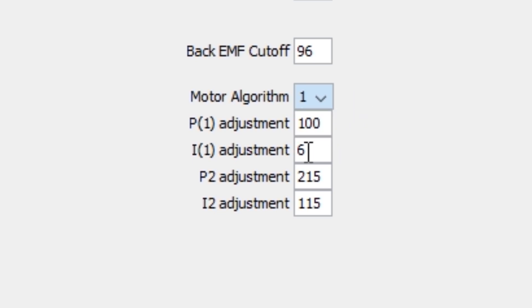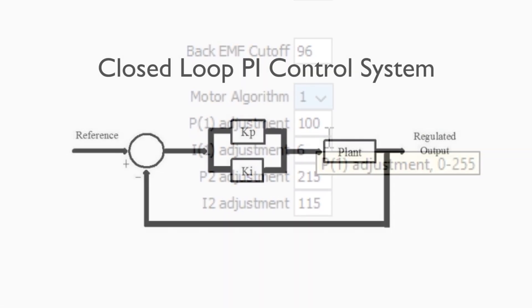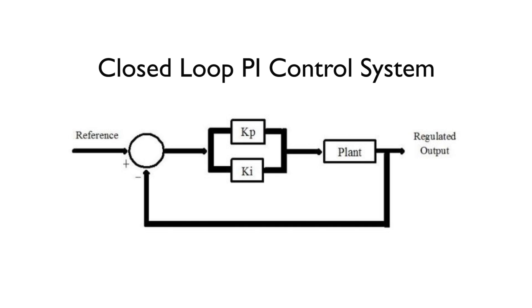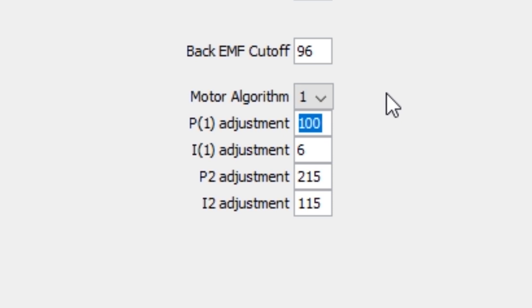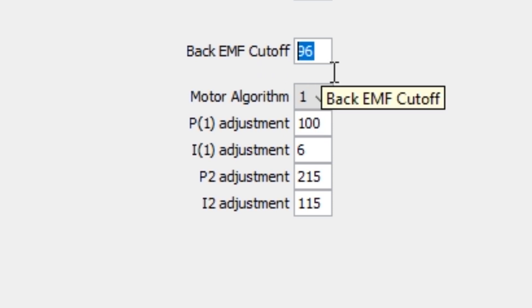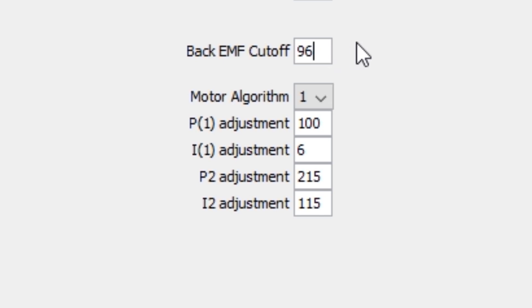Then we've got P and I values for each of the two algorithms, and each one takes a value between 0 and 255. I won't claim to fully understand how they work, but they're both variables in the decoder's built-in closed PI controller — P is the proportional element and I is the integral element. Search for PI controllers on YouTube for some videos explaining how it all works. You'll need to play around with these variables since every locomotive and motor is different, but a lower I value and a middling P value seem to work for me. This is the back EMF cutoff — it takes a value between 1 and 128 because there are 128 speed steps on the controller. For speed steps below this value back EMF will be active; for speed steps above it, back EMF will be inactive. I've set this at speed step 96, which is 75% on the throttle. For this locomotive, if back EMF is active above speed step 96 it gets really carried away and gives the motor far too much power. I don't plan to go over 75% for this locomotive because it's just far too fast, but this is just a safety feature having it cut out at speed step 96.